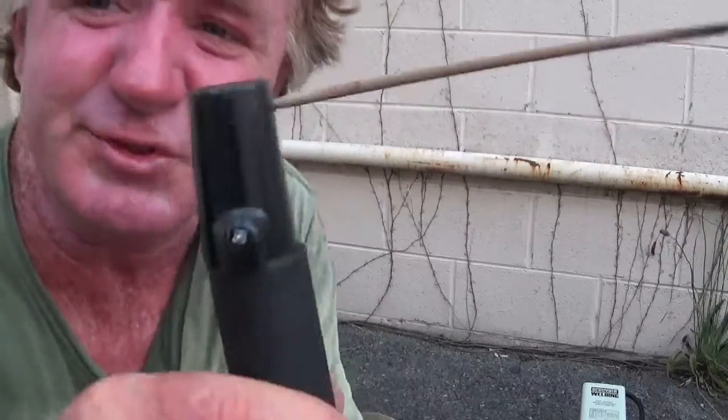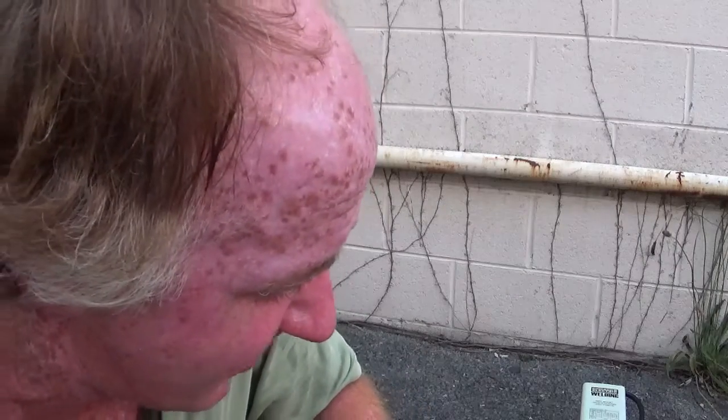So here it is. Here's the clamp, and this is made out of plastic. So this whole setup, this welding machine, is not meant for long duration use at one time, like probably past 10 minutes, because this is plastic, and after so long this part would get hot. If this was a high amperage welder, like 200 amps or 300 amps, this would get so hot that it might melt that plastic. But an 80 amp DC welder doesn't put off enough amps to get that hot. You have to be constantly going with it for hours, and this doesn't have a duty cycle that long.